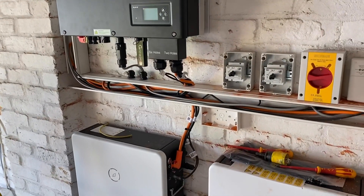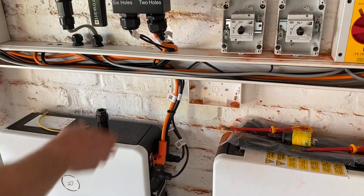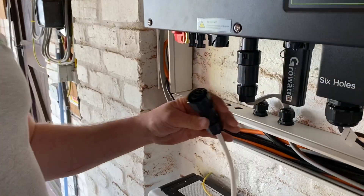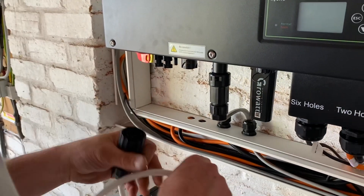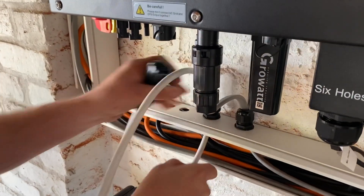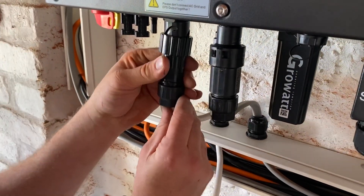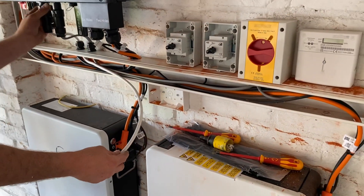So they've got one twin socket in this system. In the event of a power failure, a fridge or a freezer in this garage area plugged in there would be permanently on. The EPS lead simply goes into the output and runs down to the double socket — a plug on the end, nice and easy to make off, clip it straight into position, and the other end runs into the socket, ready to go. That one will be on all the time when the power's off.